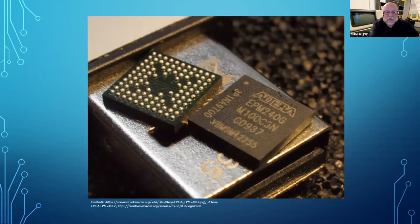The real devil in this space — which I have not attempted yet — is what's called the ball grid array, or BGA package. In a BGA package, all of the contacts are on the bottom, totally inaccessible. Your circuit board has little wells that receive the tiny ball. You put solder paste in the wells, set the chip on there, the solder flows, and it's on. There's no way to get a test probe down there to test it. It's generally considered challenging for the home brewer, but in theory it should be doable.